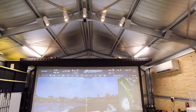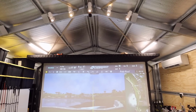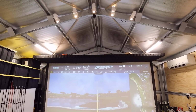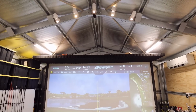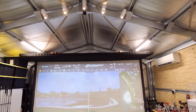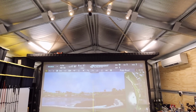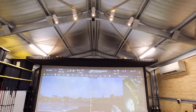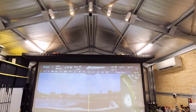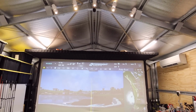So link in the description below, you'll get a better picture and a close-up look of the lighting that I use. And these are ceiling mounted spotlights. And basically there's a disc on each one of these lights that you can rotate and change the aperture on the actual spotlights. So by doing that, you can change the size of the circle that it projects onto the ground. I particularly use the largest circle, and I've crisscrossed them. You can kind of see up there, but I've crisscrossed them in an X pattern. And what that does is it doesn't allow the light to shine in my eyes while I'm addressing the golf ball or at any time in the follow through of the golf swing itself.